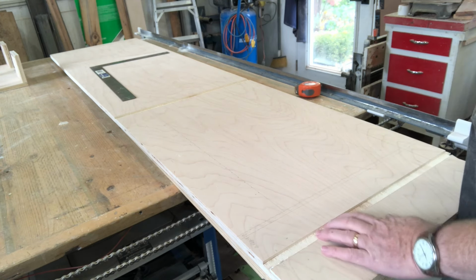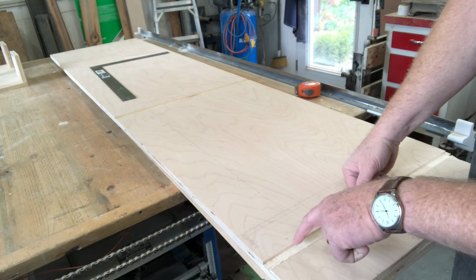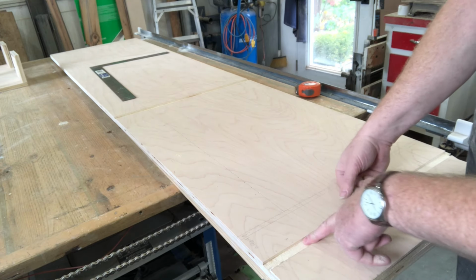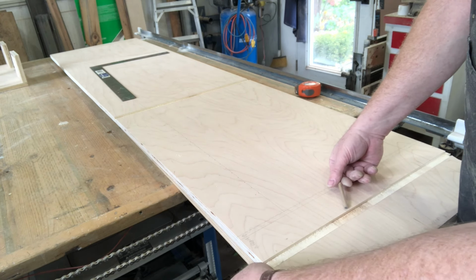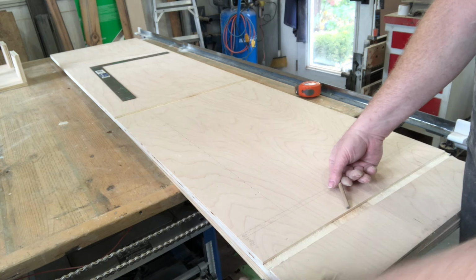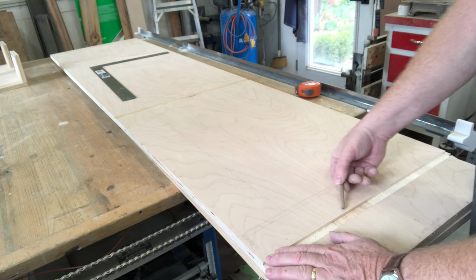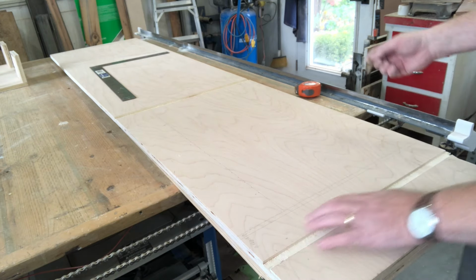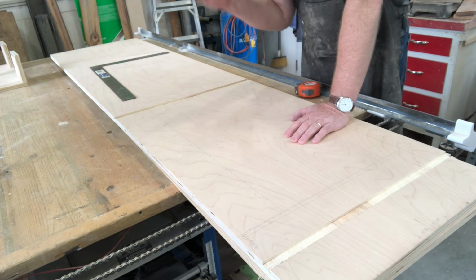And in terms of length, the cabinet is 38 inches wide overall. We took a 1/4 of an inch out of this 3/4 inch side, a 1/4 inch out of the other 3/4 inch side. So that leaves us with a 1/2 inch exposed on each side. So 38 minus the half for this, 38 minus the other half on that is going to be a 37 inch wide bottom shelf. When it comes to our anchor shelf, it too will be 37 inches in length.